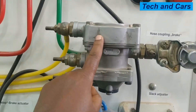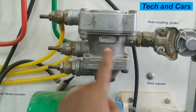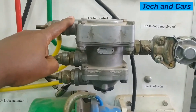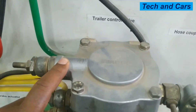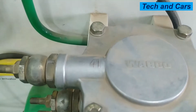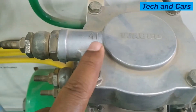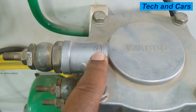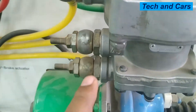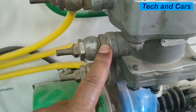There is control circuit 1, there is control circuit 2 on the lower side, and there is control circuit 3 on the middle side. Control line 1 with line 41 is controlled by the service brake circuit number 1. The number 4 represents control on an air brake system. So line 41 is connected to the foot brake valve, circuit 1, and line 43 is connected to the parking brake valve.